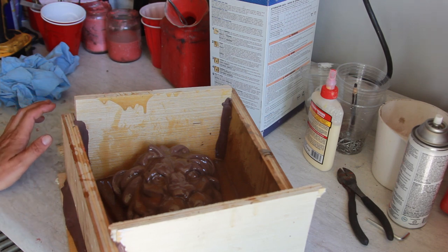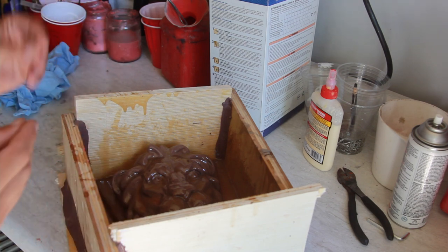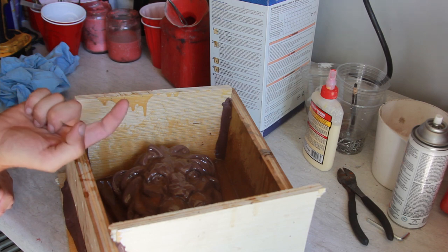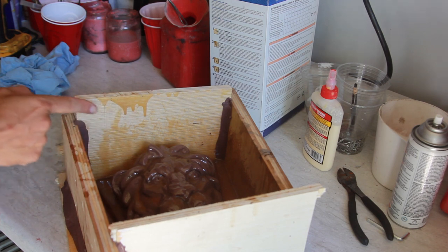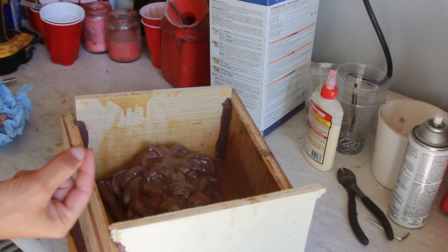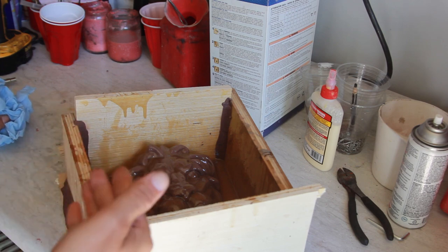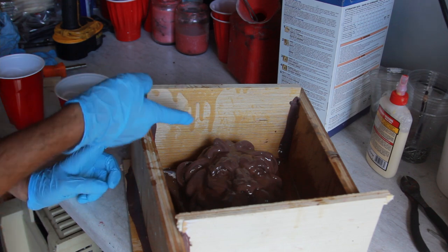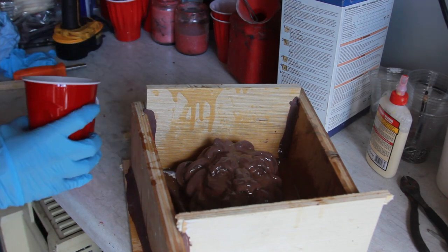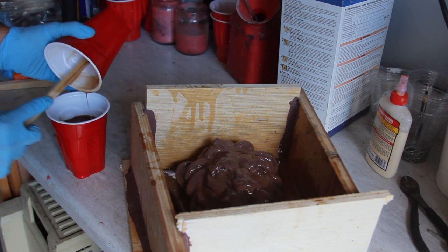The thing with polyurethane is that you have to layer it and you can't wait too long. If it becomes fully hard, it's useless because it has to tack on to the previous layer. If you touch it and it sticks to your finger, that's too wet. What you want to do is wait a few minutes, come back, touch it, and if it's tacky but doesn't stick to your finger, that's the right consistency to put the next layer. I waited about 20-30 minutes and it's perfect. I already have my rubber here and I'm going to add one more layer, but this layer I'm actually going to add a fiber.